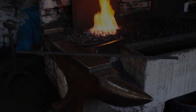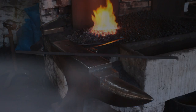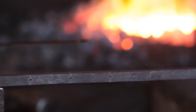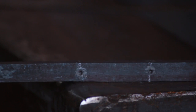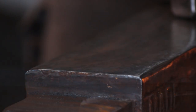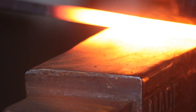Here is our half-inch square bar, three feet long — 36 inches — marked at two inches, eight inches, two inches, two inches, eight inches, two inches, two inches, eight inches, and two inches. We're going to be forming all three bars on the same bar and then folding it together. All measurements are center-dotted on all four sides for ease of use, because we're going to be folding this at some point. To start with, we're going to get a nice decent heat in it.